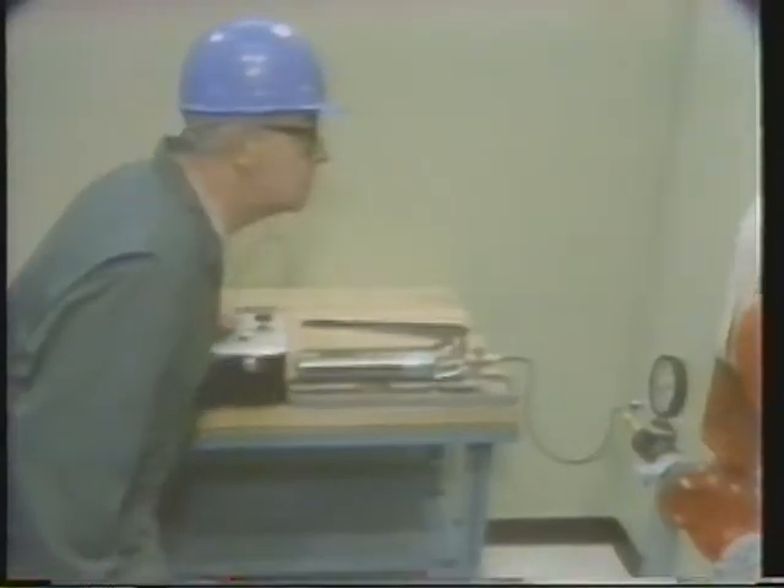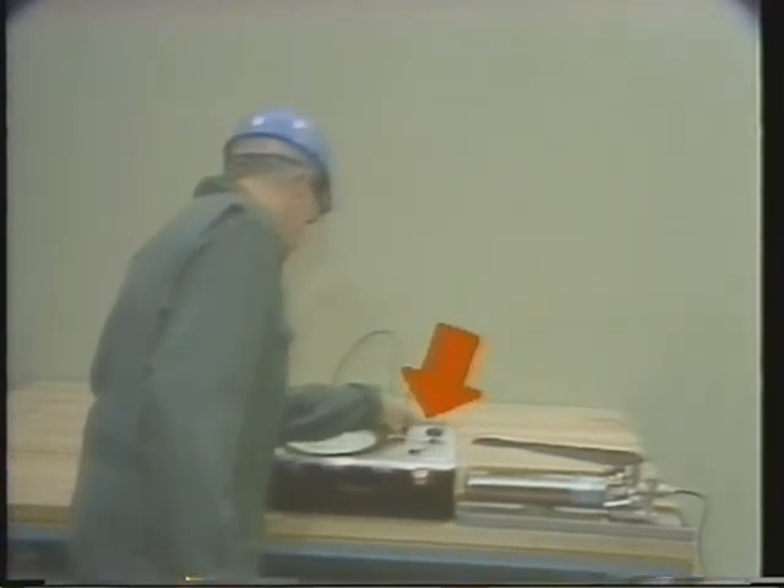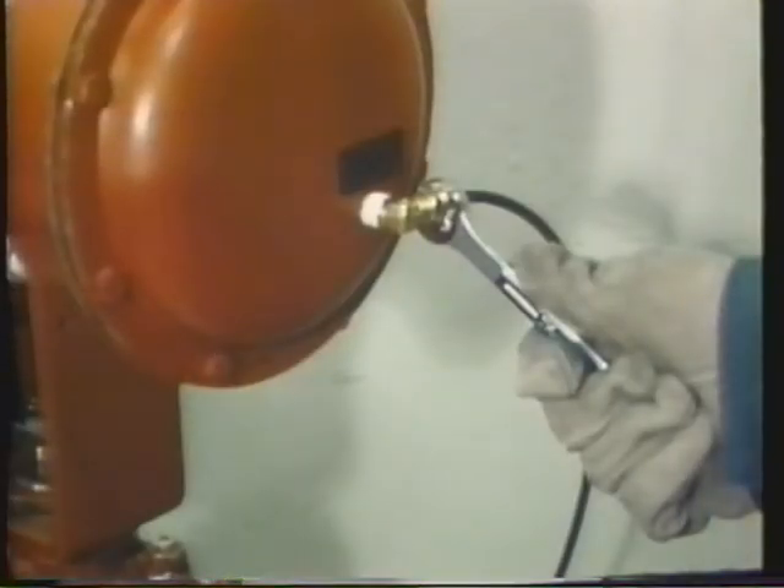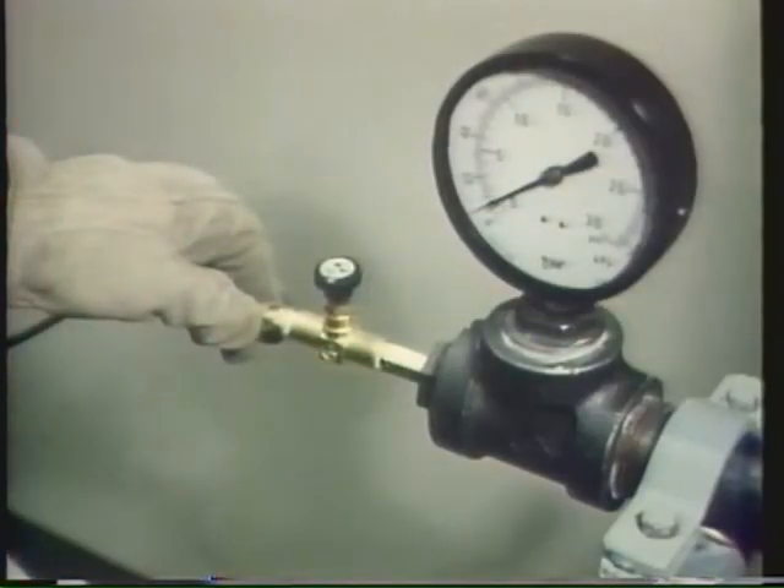In the previous segment, we saw how to properly reassemble a globe valve that was overhauled. When a valve is reassembled after an overhaul, it should be tested for leakage before being returned to service. Our technician is using a pneumatic comparator and a hydrostatic tester. The pneumatic comparator is connected to an air supply at the test bench and to the valve's actuator, so the air supply can provide power for necessary movement during the leak test. The hydrostatic tester is connected to the inlet piping so water can be sent to and pressurized in the valve during the test.